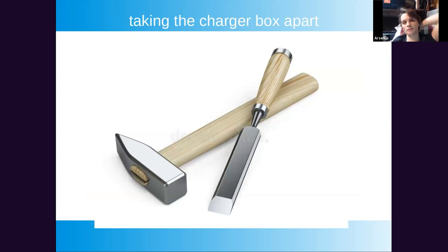If you need to take a charger apart and it doesn't have rubber feet hiding screws, the best approach is a chisel and hammer — the case is likely ultrasonically welded. Take the chisel, hammer it around the perimeter of the charger along the seam until it opens. Once it's open you do whatever you need to do, and you can even neatly super glue it back together — no need for electric tape.